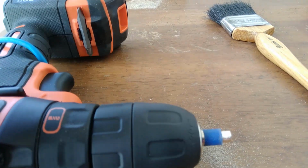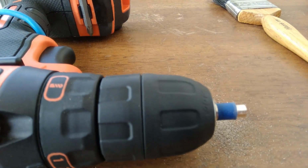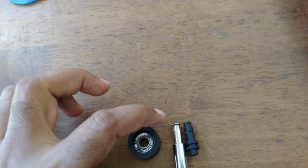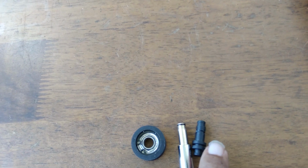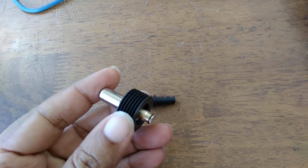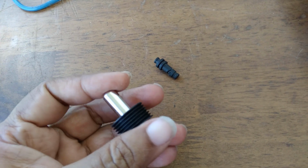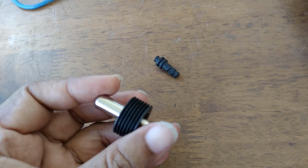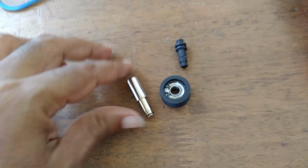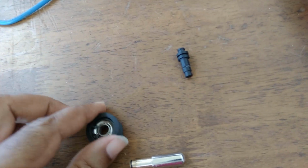The bearing will sit fine. I just needed that so I can test the bearing often, so I need to cut that down. It's not to the correct depth, but it's a good start. We're through. We finished this side. We put a notch. Hopefully it's good enough. It's slightly under the size it needs to be, so this slips in without an interference fit. But that would have always been very difficult. Getting too tall on something like this is going to be hard. So it's slightly under, not a problem. I can probably just put a touch of glue and that will keep it. Either way, that's a bearing, just to hold it in there.